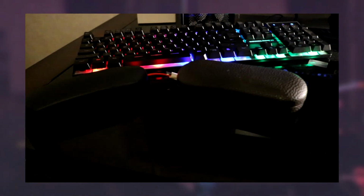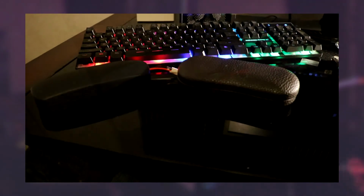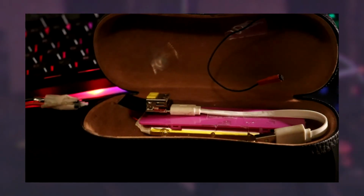I also since upgraded the battery, since the battery did fail over the years. I did say the battery was reclaimed, so I expected it to die, but not a few years later. Anyway, it did die, and I took the charge function from it and incorporated a newer, larger battery. Now this battery and charger IC worked kind of like a UPS. I could plug this thing in, use it, and if you lost power, it would stay on, continue doing whatever I had it doing at the time.